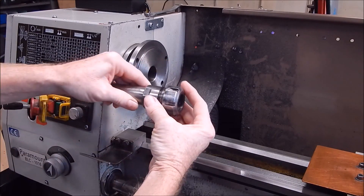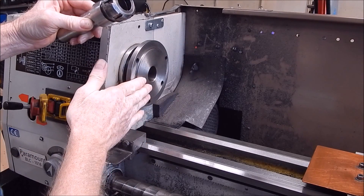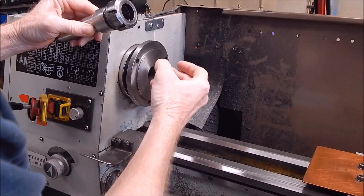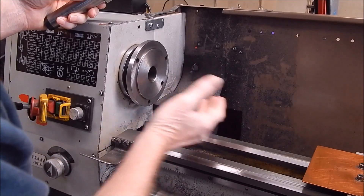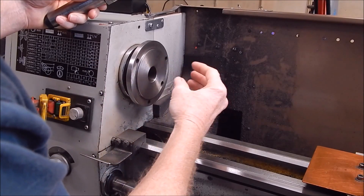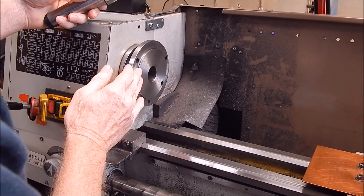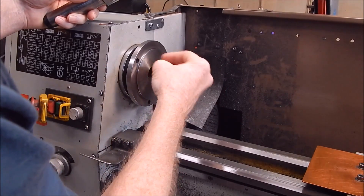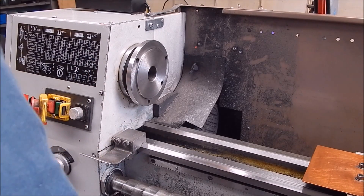An alternative way of mounting is to buy a collet chuck with a big metal plate on the back which mates with your backing plate on your spindle — the same way as a normal chuck. That way you still have the benefit of feed-through as well, because there's nothing blocking the back of the chuck. The other mounting method is a threaded spindle nose — as I showed in my video for my old Schaublin 102 — they just screw on and also allow feed-through.